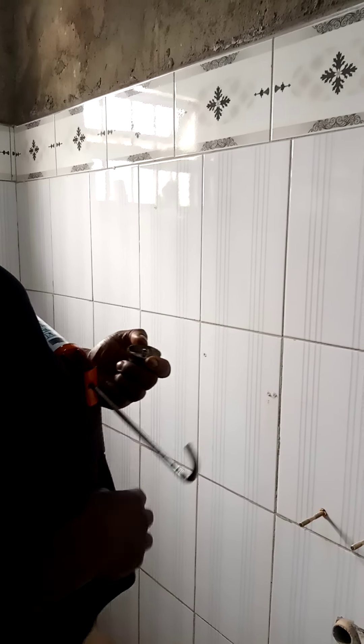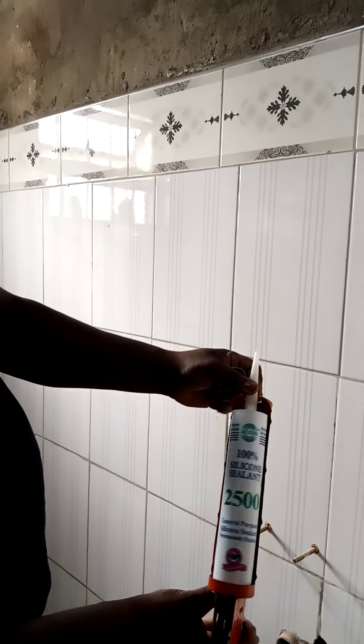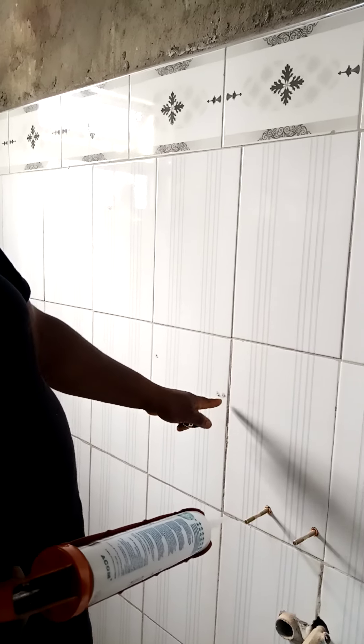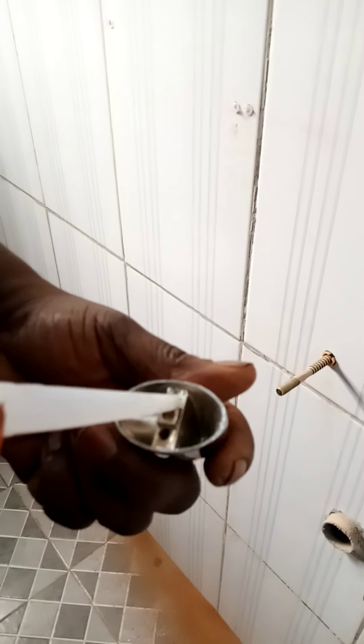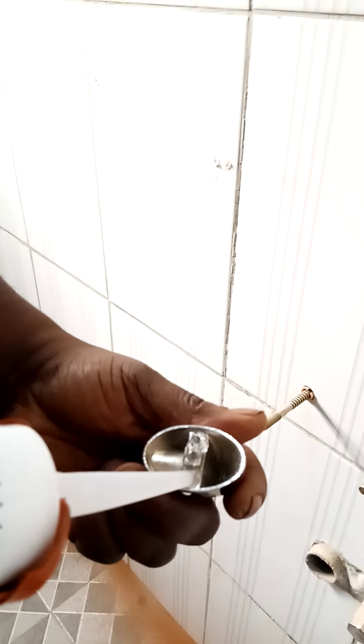Today I'm just showing a little trick I do. I use 100% silicone — make sure it says 100% silicone because this stuff will stick heaven to hell. I already pre-drilled my holes and put anchors in them. You can see in another short how I put the anchor in a hole. So I put an anchor in each hole and then it's going to align with this here. Then you put a little 100% silicone on the back because it's going to act like an adhesive.